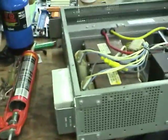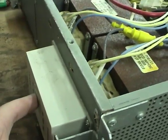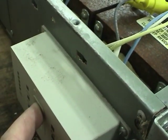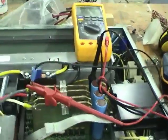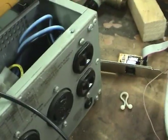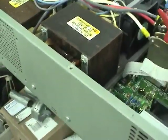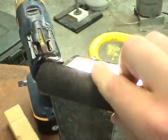Now we've got to get a 208 volt load and see if it can actually supply anything. Let's see if it'll cold start. No, it doesn't seem to want to cold start. I just noticed this does have 120 volt output, and I think that's what this transformer is for — to transform the 208 down to 120. Let's plug in a 500 watt lamp and see if it runs. Yep, that seems to work. Will it run on UPS power? Let's pull out the plug. And it does seem to work.